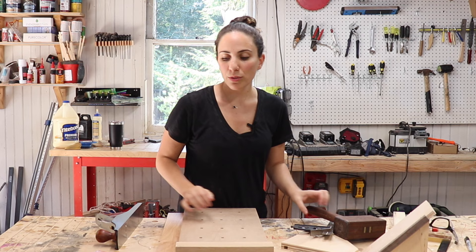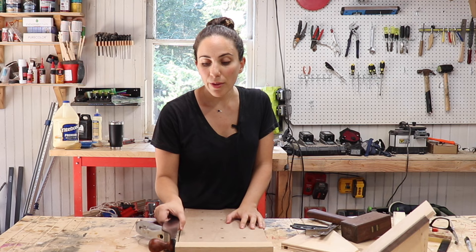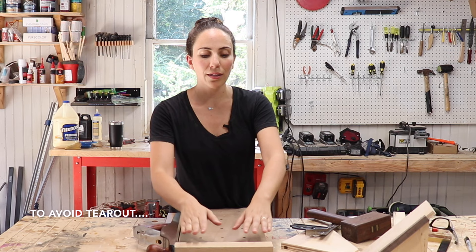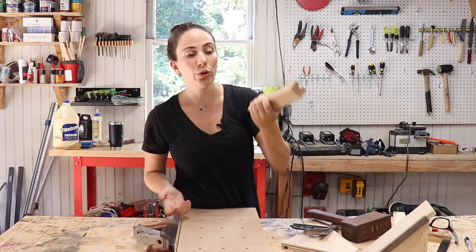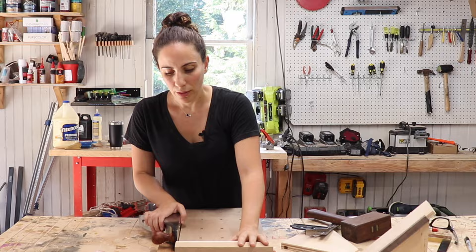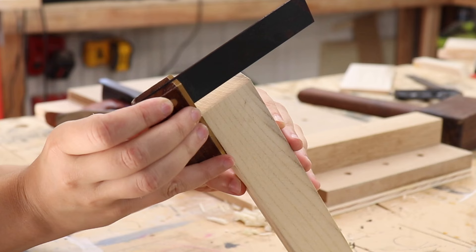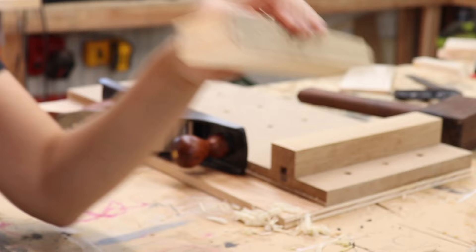The first attachment — the regular fence — just slides onto the skinny fence, locks right into place, and you can tap it side to side to adjust position. This is great because the plane can eat into a back fence over time; instead of a permanent glued fence, this one is temporary, so you can plane the edge square again or just make a new one. You just butt it up against your plane and start planing — perfectly square both ways.